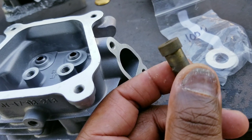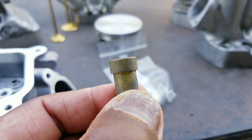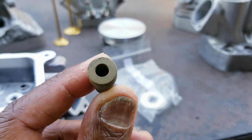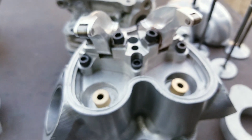This is maybe 6mm. There's a step on there — you see this? That's the difference right there. This guide cannot fall. It's longer, it's stronger, it's thicker. It's way better than a stock guide can ever be. And this is what I use in my heads.